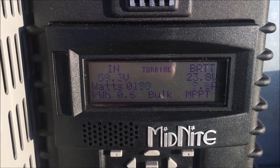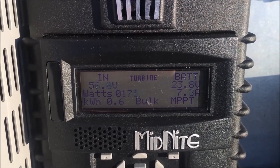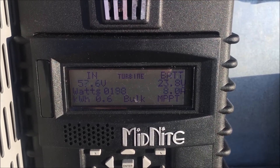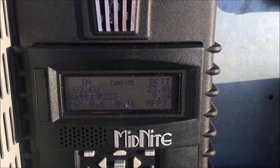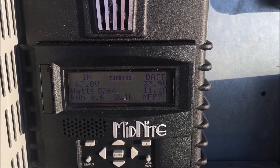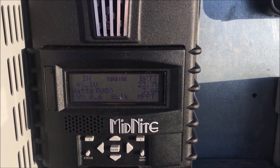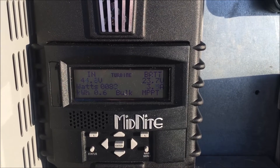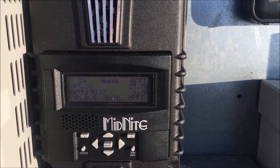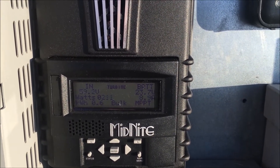I have a 250 classic set up right now. I've got a pretty good draw on my 24-volt battery bank — not only the inverter running, but some heaters and battery chargers taking care of batteries on equipment inside the building. Right now the battery state of charge is about 86%, and it's been pretty steady at 86% running all night, with the wind maintaining that percentage.